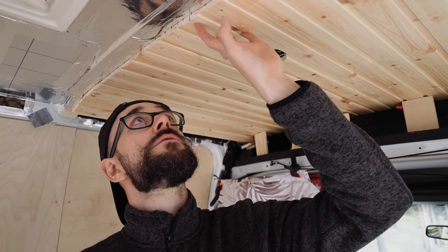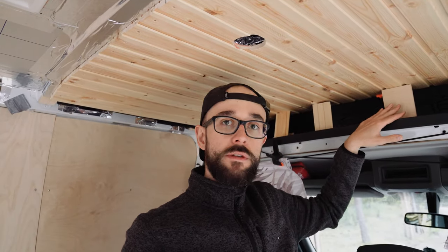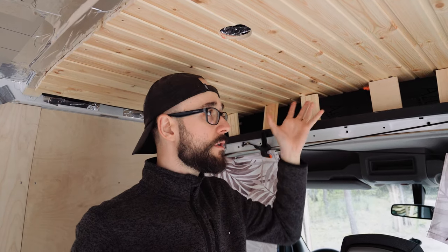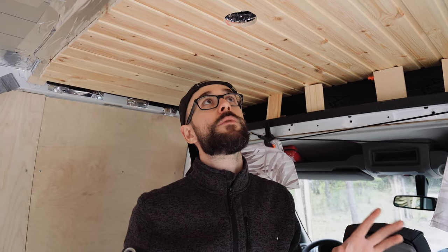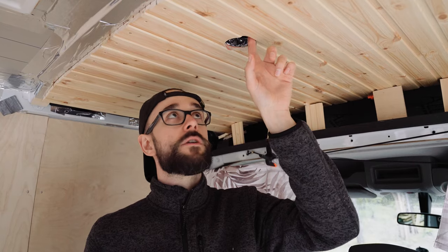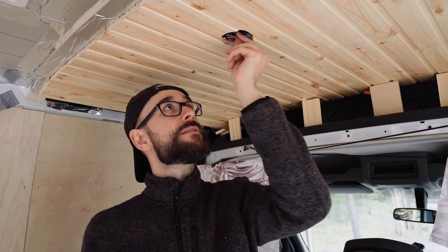This is our favorite tool we got — we should have bought it a long time ago. It has a strong battery so we can work with all the screws and drill things in wood just holding it here. We prepared pre-made holes for the screws to hide them inside the ceiling, mounted the ceiling, then glued it and clamped these little pieces to hold it while the glue set. We had to do some precise and tricky cuts — here is the part where the light goes and we pre-made the hole in the insulation. Here is the cable that we'll attach, already connected and prepared.